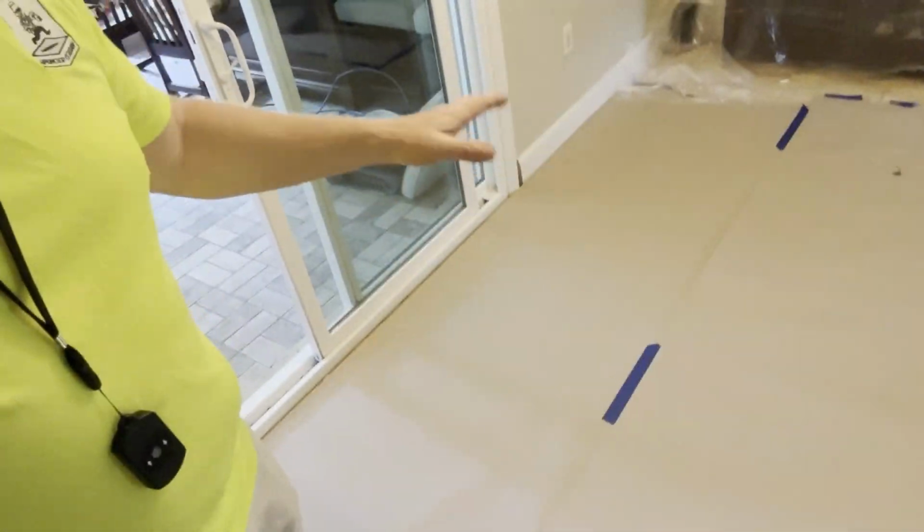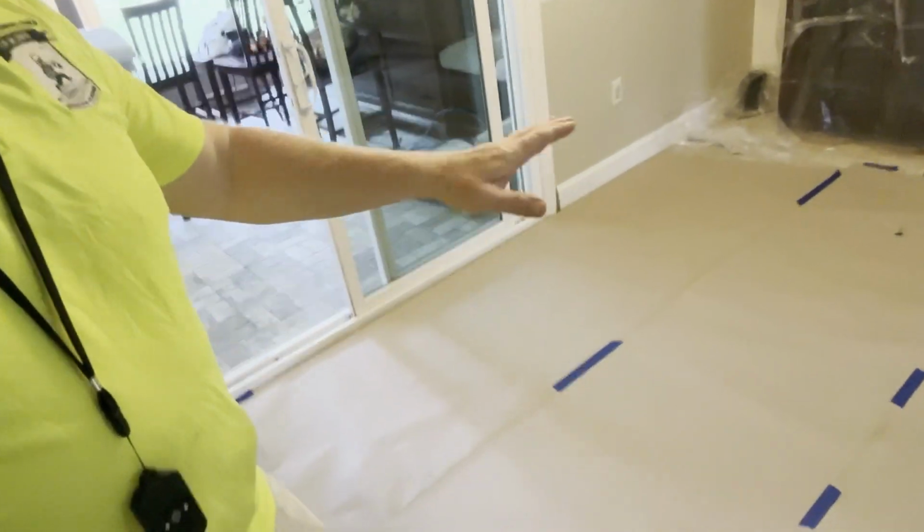So you don't want it on your floor. You don't want to say, just scrape it off, get it on the floor, we'll clean it up later. You'll be working at least one full day getting this stuff out of your grout. So I suggest two layers of paper, and then in between the paper you put painter's plastic so that the saturation doesn't compromise the integrity of the paper that you're using to cover your floor.